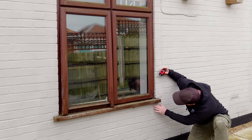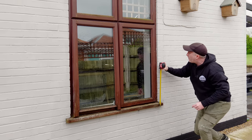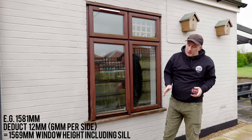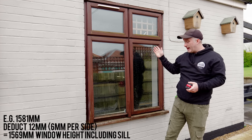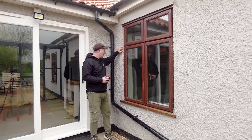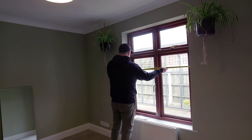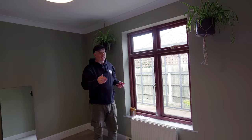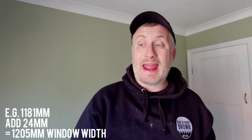For the height I can see the bottom of the brick is here and if I look under the sill I can see that the sill is sitting on the top of this course of bricks, so I can simply hook my tape measure over the bottom of the sill which gives me 1581. Again I'll do that on the right hand side, in the middle and on the left hand side. Whichever dimension is smallest I'll then deduct 10 to 12 millimeters and that gives me the height of the opening including the sill. Now the reason that this one is more tricky is because the walls are rendered, so the inside of the window frame is kind of beyond this render around the outside. Instead, internally I measured from plaster to plaster — the internal dimension is 1181 millimeters. Again I would measure top, middle and bottom, but this time I added on 12 millimeters for each side of the window to account for the thickness of the plaster. That should ensure that my window fits the opening externally and butts up against the edge of the plaster internally. We'll find out later in the video if my windows fit, but obviously every building is different so do your own research.